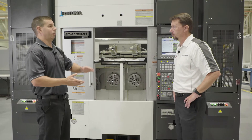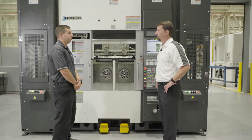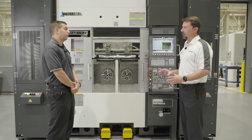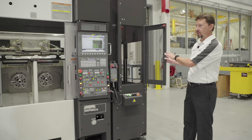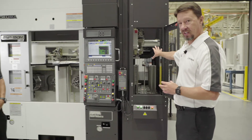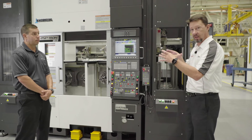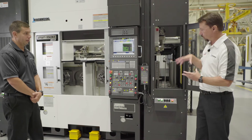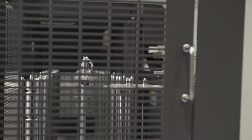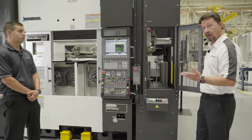If we want to switch the workflow, we can do the exact same thing going the other direction — so no matter where this is in your building, it's perfectly flexible for your workflow direction. The stocker tables are offered in a standard configuration of 16 stations and are easily adjustable by turning plates in the bottom to change the diameter of parts going in. Proximity switches on the side tell the gantry where the parts are, automatically feeding up until the switches confirm a part is ready for the next operation. It's a very simple system to set up for new jobs.